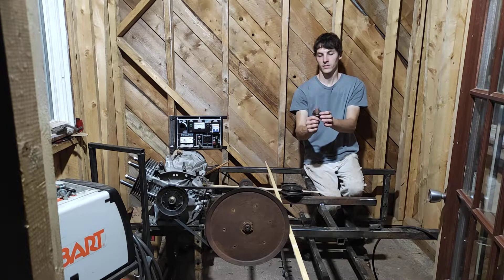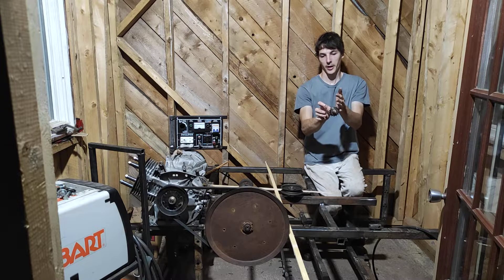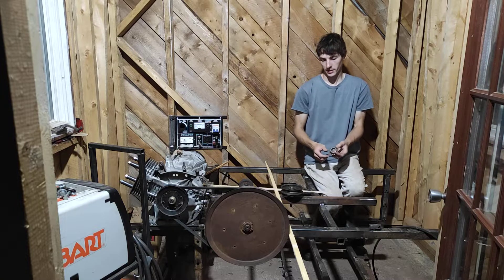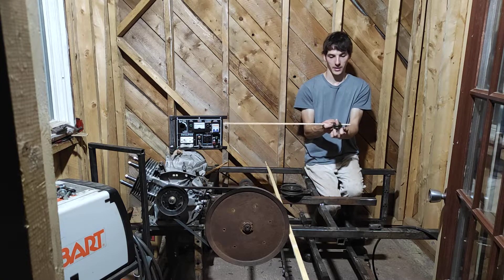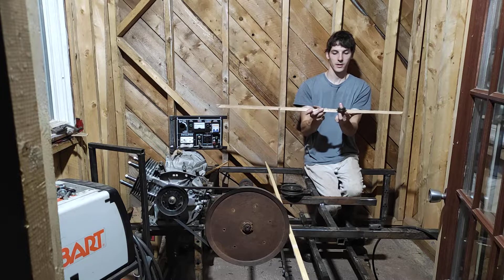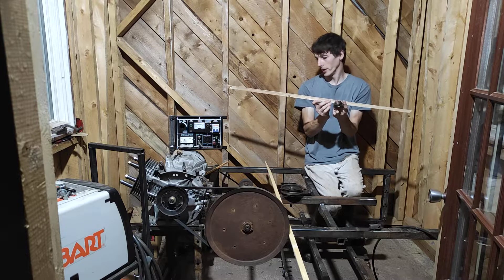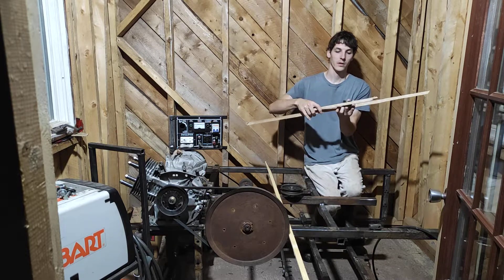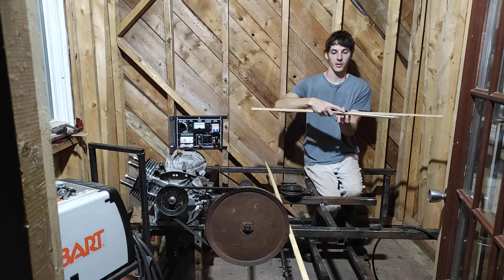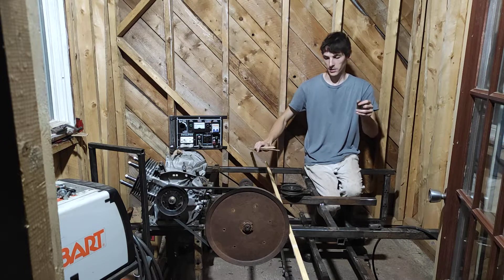For your output, this is off a bicycle ratcheting thing. Automatic transmissions have much better ones — sprags, ramp roller clutches, or one-way bearings. This is a ratcheting thing, so you can put a chain on here. When this comes through, it spins the shaft one way and then ratchets the other way. You can put one on top flipped over on the same shaft, so whether this thing is moving backwards or forwards, it still turns the shaft.